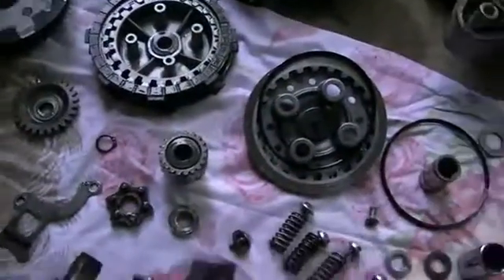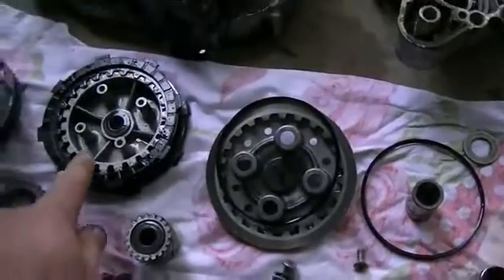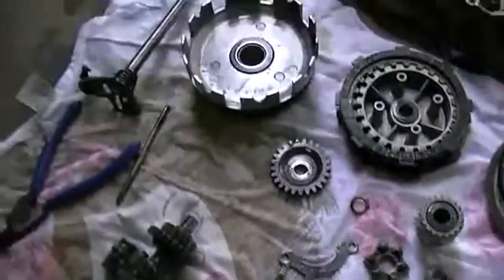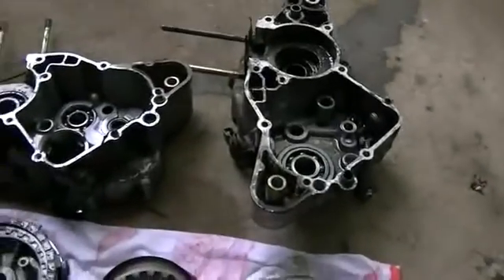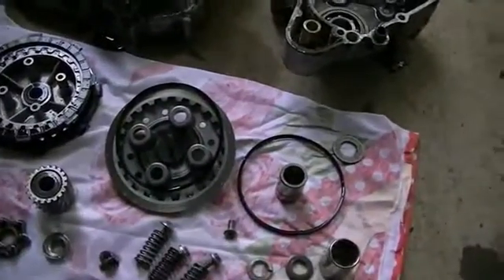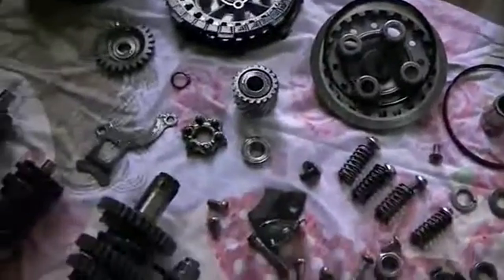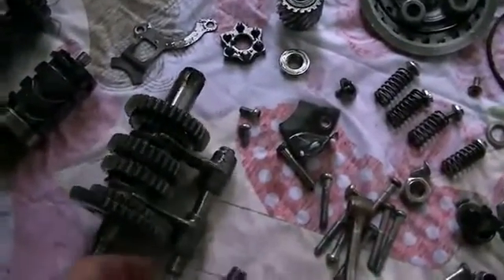The clutch pack you won't need — I'll simply screw the drive plate straight to the basket. Gears will be going back in along with our selector shaft, and of course we'll clean that back up. Put a cap on top of the open crankcase, seal that off, and put the covers back on. Make sure the unit is all sealed again — we can then put some nice thin machine oil in the gearbox to reduce the friction inside it.